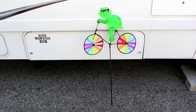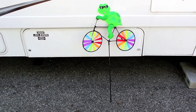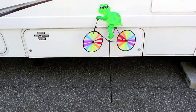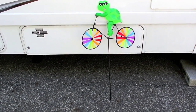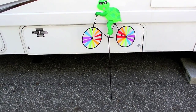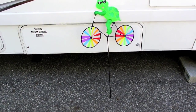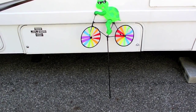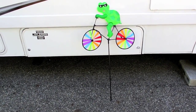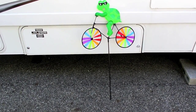I'm going to use some steel tubing and make some tent stakes that are hollow, so the little poles that hold these whirligigs up will fit inside. Then I can pound the tent stake itself into virtually any kind of ground. And with a little tent stake type hook, I can just put a rope around it and yank them out. It's a small, minor, fun project, but it makes your life easier, so it's worthwhile doing.